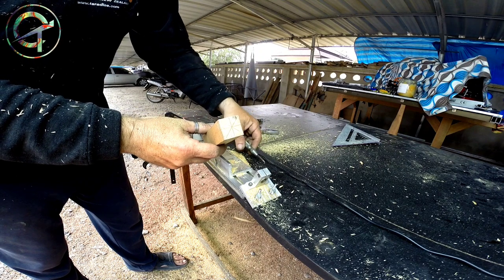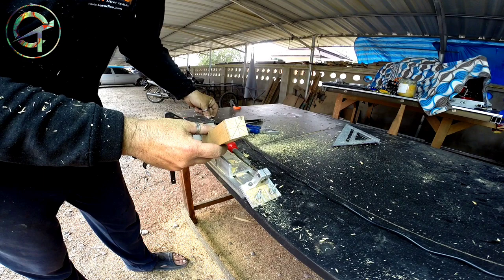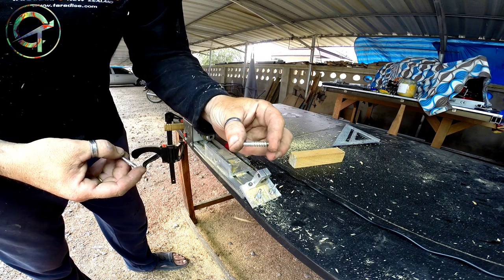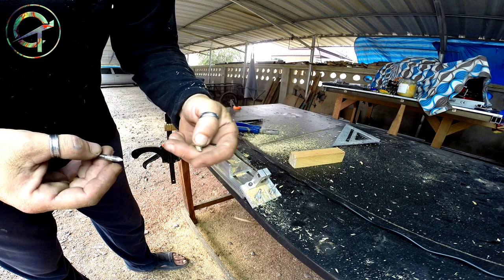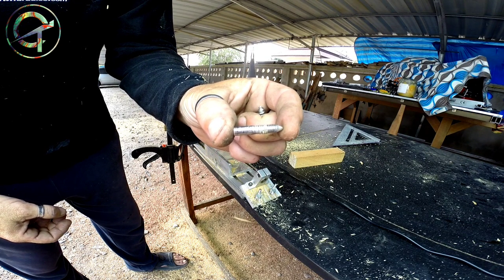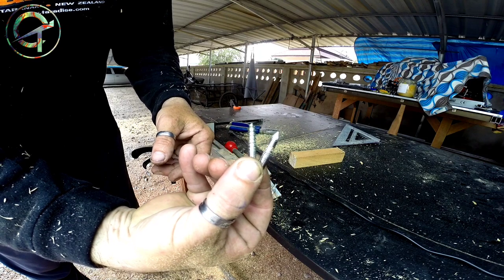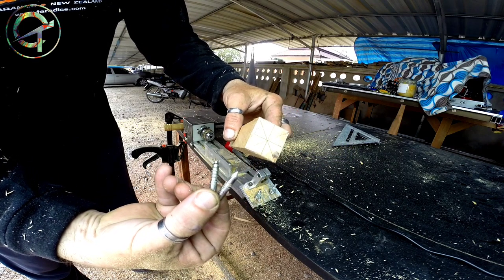I took my time and already marked the piece center. I never used a lathe before, but it doesn't take experience to understand that the needle on the chuck side should be perfectly centered to the turning piece — and most importantly, it must be locked firm in place. By cutting bolts I made myself a couple of needles. It's important to have a needle with a thread that is not sharp and aggressive — otherwise, after a few turns, due to the turning force, an aggressive thread is going to hit the timber fibers and the piece begins to spin on the needle. I can see a couple of different threads here and both are working fine in my case.